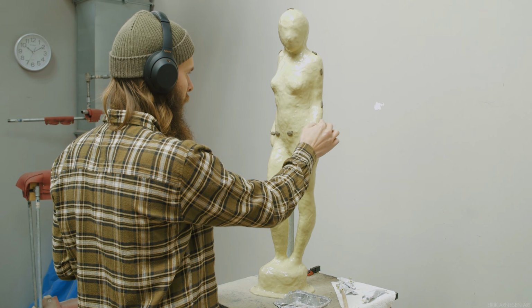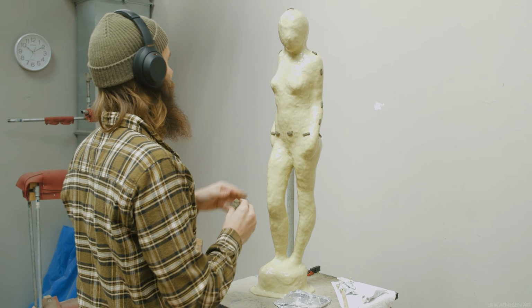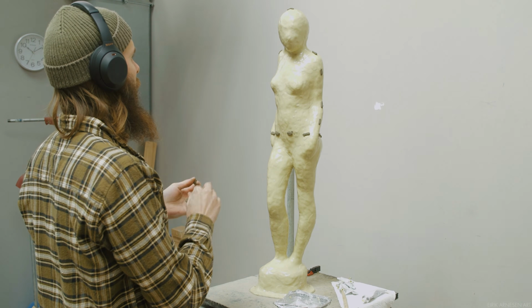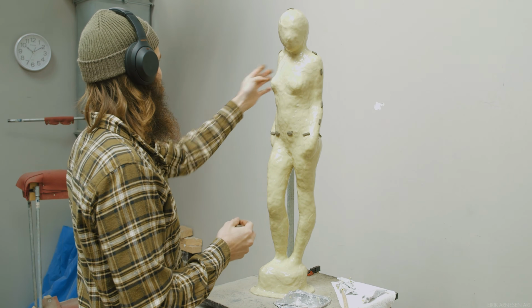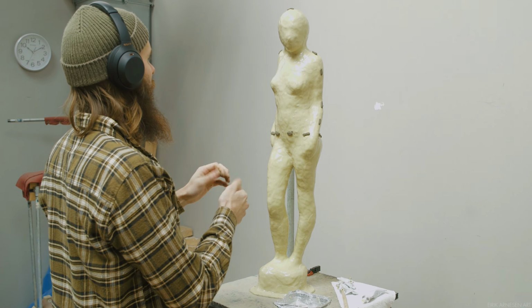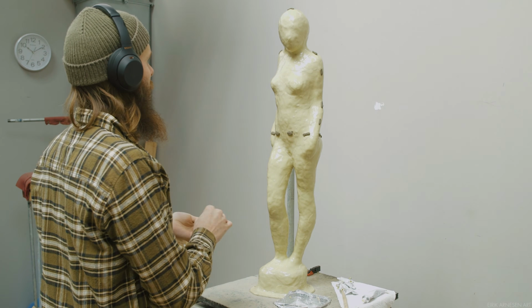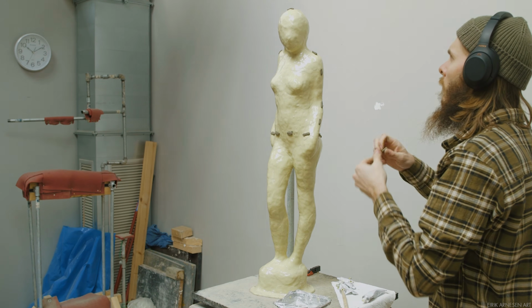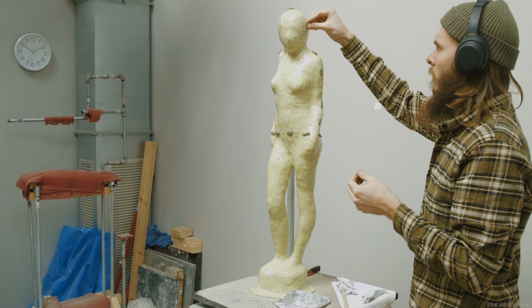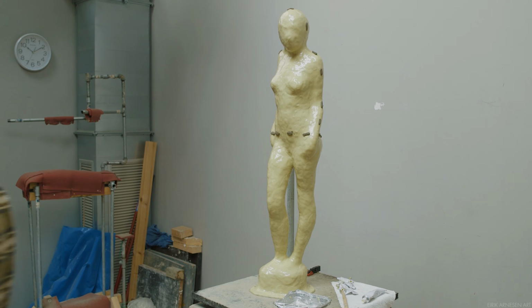With the decision made about separating into upper and lower half, it's time to decide how to separate the upper and lower half again into two separate pieces. I prefer two pieces as two pieces come back together really easily. So as a general rule of thumb, I would always encourage you to separate your silicone skins into two halves, two pieces. The mother mold can be more pieces, but two halves for the silicone skin is a good rule of thumb.